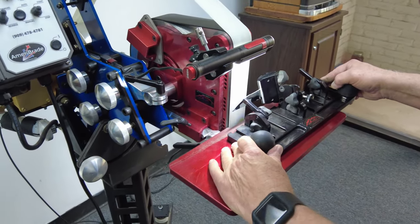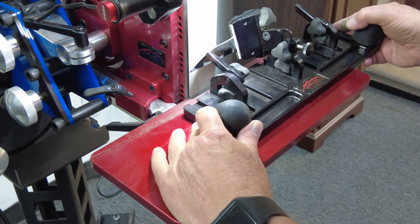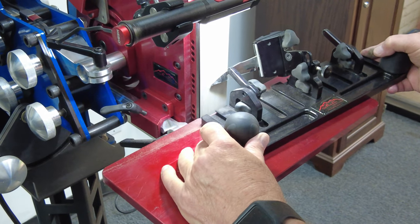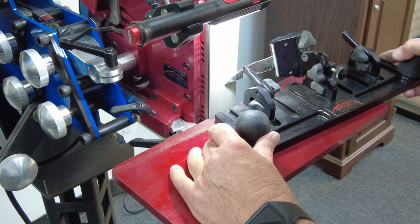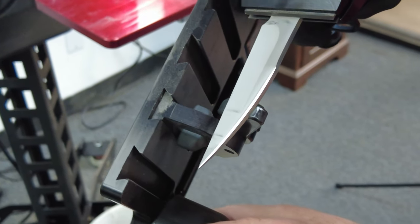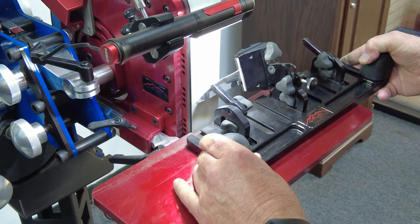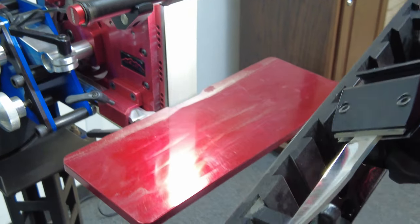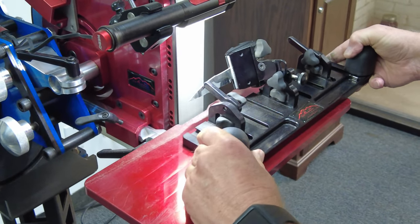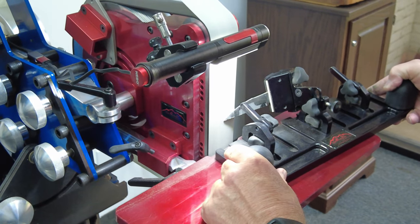I'm going to come in behind it. That bump right there — I want to make a swedge, but I want to begin before the hump so it blends and looks really cool when you follow that knife blade. There's the tip. You can begin seeing what's happening — see that accent swedge? And of course if you repeat on the other side, you can bring it on down a little more, bring it to the end of the point.